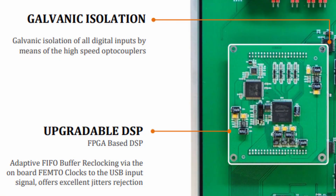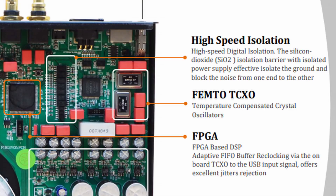There's one more thing to explain before moving on. There's more to a good clock than just the quality of the crystal oscillator, but it's fair to say the crystal oscillator does have a significant bearing on clock quality. The Denafrips Ares 2 and Pontus 2 use femto crystal oscillators by a company called NDK — femto referring to the precision of the oscillator. However, these are voltage-controlled crystal oscillators (VCXOs), which are found in most DACs, and the problem with VCXOs is that the stability and output of the oscillator varies with temperature. The Denafrips Venus DAC and the Iris use temperature-compensated crystal oscillators (TCXOs), which include a thermistor circuit that accounts for temperature variations to stabilize the output.